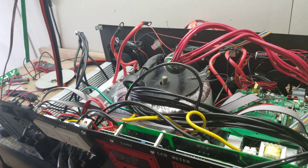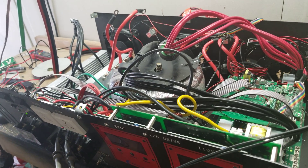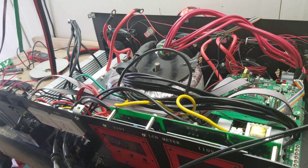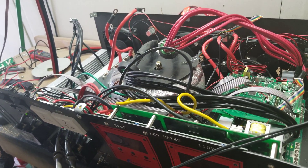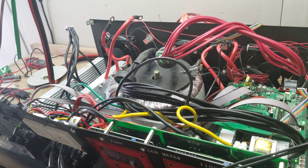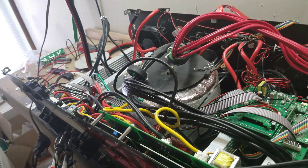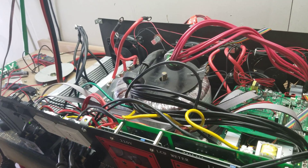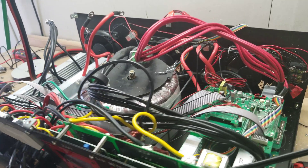The second time around it destroyed my washer. I finally requested they send me a new transformer — this was before I worked for PowerJack — and they did send me a new transformer, and it fixed the problem. Now this is one of those warranty repairs that came in a while back with line noise on it. The options were: disable L1 altogether and sell the inverter as L1 or L2 only, come up with a way to fix the problem, or replace the transformer altogether. These transformers are expensive and heavy, expensive to ship, so I set this aside and we brainstormed how we could actually clean up this line noise — and the answer was filtering.